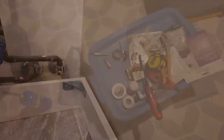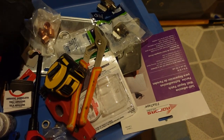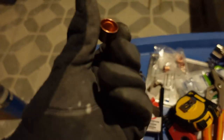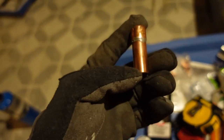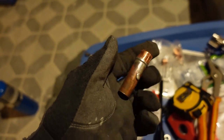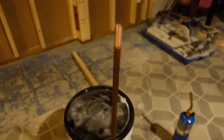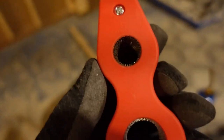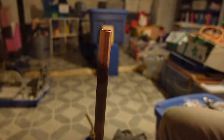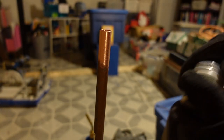I do that on the table saw. Now I'll take a quick break to talk about soldering. I have a whole bunch of extra pieces I practiced soldering with — I'm not a plumbing soldering expert by any stretch. What I did was buy a bunch of 50-cent copper caps for half-inch pipe and practice on a chunk of half-inch pipe I had sitting around. Those caps are 50 cents Canadian so that's pretty cheap. They do get hotter much faster than shutoff valves, but it is very similar to the shutoff valves overall.